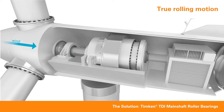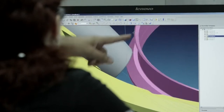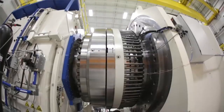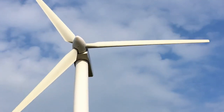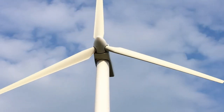The main bearing is a very challenging application in wind. You're looking at a bearing that has to handle all the loads from the wind coming at it — both direct-on loads as well as very dynamic loads, because you have different wind speeds closer to the ground versus higher in the air. You also have the massive weight of the rotor, many tons pushing down on it. So you need a bearing that can handle a bunch of different loads simultaneously. A typical gear-drive turbine, which is very common in the U.S., uses a bearing about three feet around.